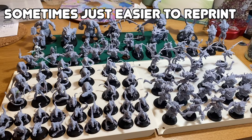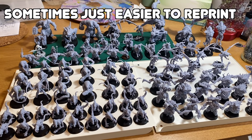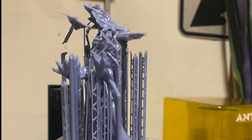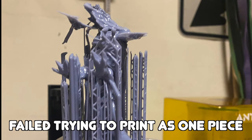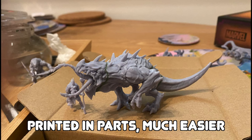You're going to have to balance your time and your resin — is it worth putting the effort into saving, or are you better off just reprinting? For larger models I have put in the extra time because it is a significant amount of resin. One thing I've done with bigger models is print them in parts, so if there's a misprint I just reprint one part rather than a really large model.